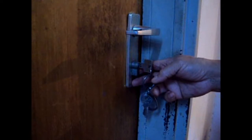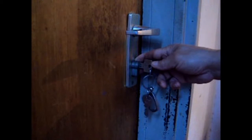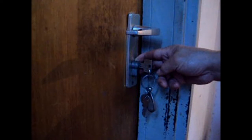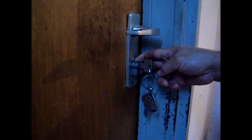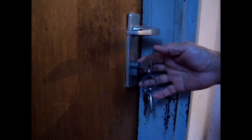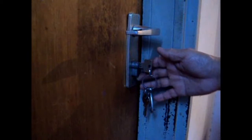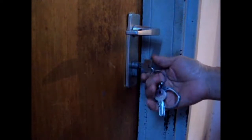This discussion is to prevent the profile cylinder or the Euro cylinder from being snapped from the outside by any kind of illegal entry through snapping this cylinder. In this case, the cylinder is too long and it can be easily snapped by means of snapping tools or an ordinary vice grip, because it can be cut from this side and then snapped easily and opened.